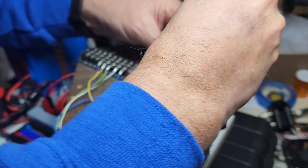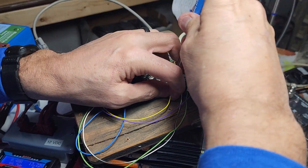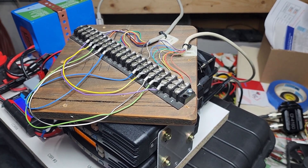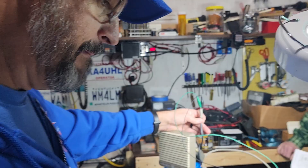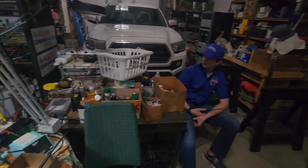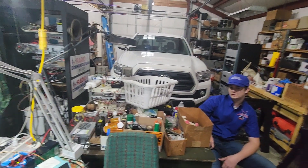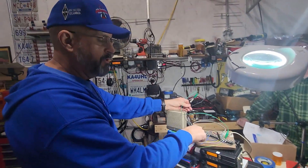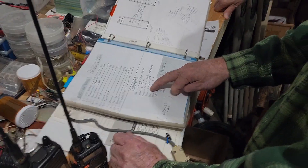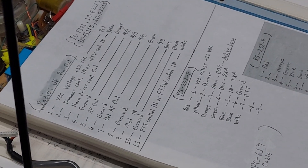The great thing is Don, AC4OM, has one of these breakout boxes that we can connect the various wires for the cables coming out of the radios and see if we're seeing the right receive, transmit, PTT, and all of that. Once we played with this for a little while, we finally decided the UHF radio — similar to the one Chris had in his video — was not transmitting correctly. So we've got a UHF radio not quite working as we had hoped. We've got a couple of radios coming from a viewer of the program, and we're going to incorporate those and hopefully those will work as intended.